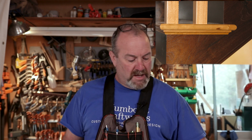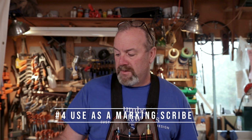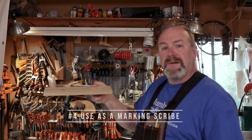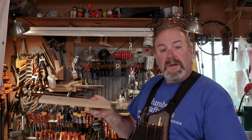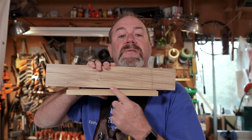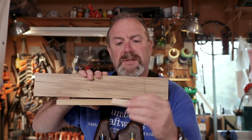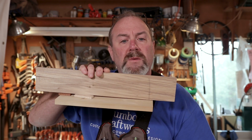Yeah. If the wall's crooked, this is crooked, that's out of whack. These little things will save your butt. There you go. Oh, also on installs, if you ever have to scribe anything to the ground, let's say your ground's here and it's all crooked, and there's a 1/4 inch gap here and it's tight here. So you've got a 1/4 inch gap over here on the floor and it runs to 0 over here. You say, okay, that's a 1/4, I got my 1/4 inch piece here, right?